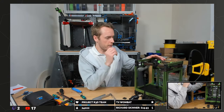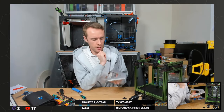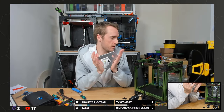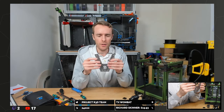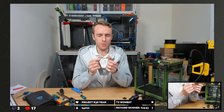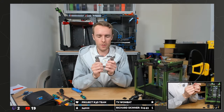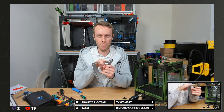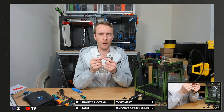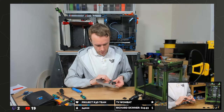We did a bunch of disassembly, and we encountered some issues with the bed, the Kirigami folded sheet metal. Mostly worked through that now. It's basically just that the manufacturing tolerance of the folding is not super great. With a bit of manual tweaking, I've managed to separate the plates a little bit, so they're further apart and they should fit this piece now. So that fits okay.